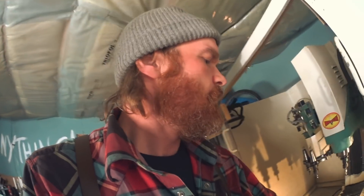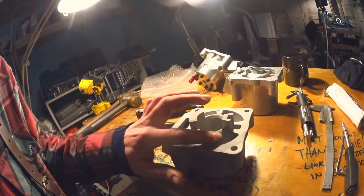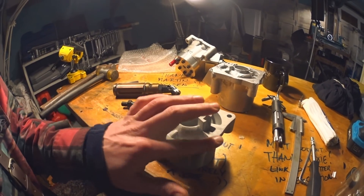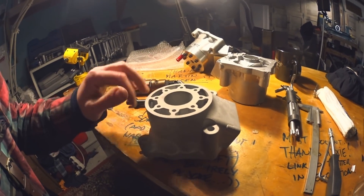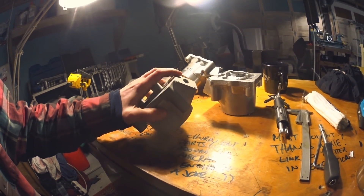Maybe I'll just go back to the old one for a while — just seal it up, it's leaking. I'll hook up the old system, and as soon as we get those capacitors we'll start making a fixture plate. I've got a lot of aluminum here, so I'm going to make a fixture plate for the cylinder so I can orient it correctly — have the mill face around certain areas and leave others alone. I'll also need to make an angle plate to machine this surface.